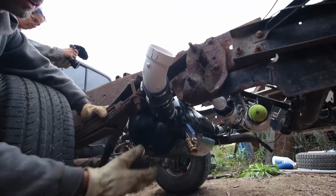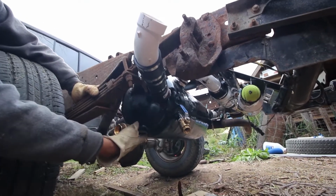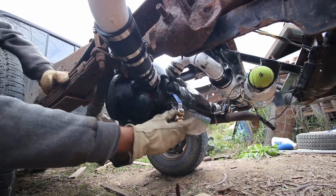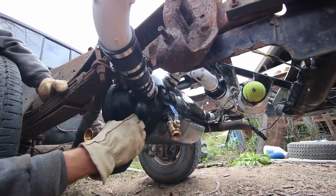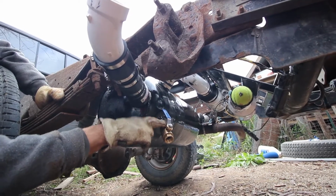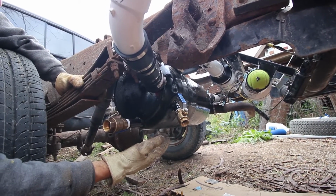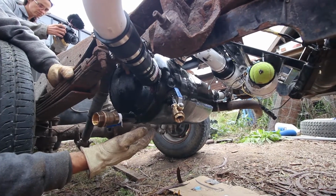These two valves are where we'll drain off the tar. This is any of the heavy tar, petroleum byproducts that may collect in the system. You can use those for starting a fire or putting on an asphalt road, but we can collect them here and not drip them into the atmosphere. And then this is the valve where we release water that's collected in the system. You see they're at different heights. Tar will go to the bottom, the heavier material, and then the water is a little bit higher, and this allows us to take the water, which will float on top of the heavy tars, and drain it off separately. The advantage again is that these are metal valves in a metal tank, and we can heat this up with a torch if we need to get the tar especially loose in the event of really cold weather, and we collect a lot of tar and need to get rid of it.